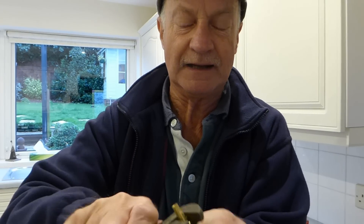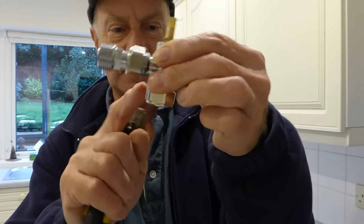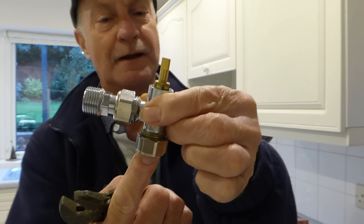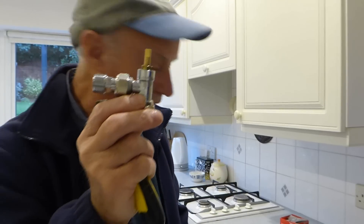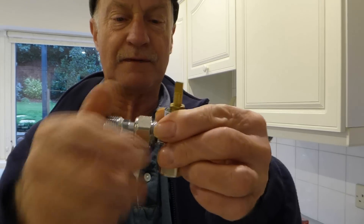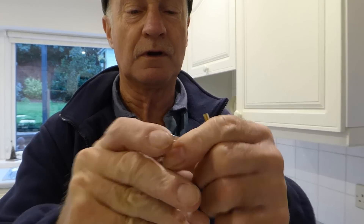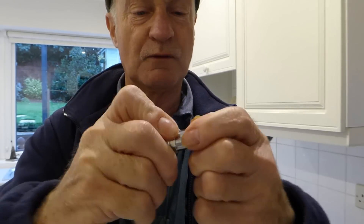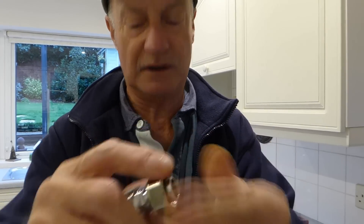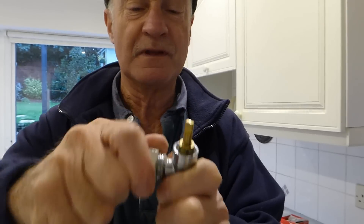But what I've been getting lately are problems not with that leaking, but with either the nut leaking before it goes in the radiator or the pipe that goes in the bottom. This is a different matter altogether. So I'm going to cover the two types of main valves. One is this type, which is the conex type. It involves a threaded part that goes in the radiator, and a nut and olive on this part — they just slide on and go into the valve.